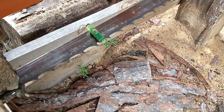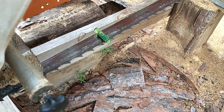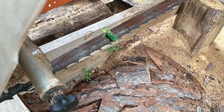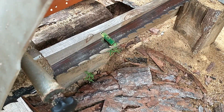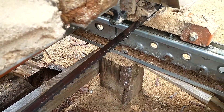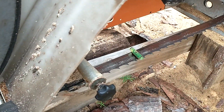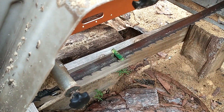I've adjusted the blade — it was just a half a turn from the manufacturer's suggested setting. You want to do this with the blade fully tensioned; track it first because that'll get you close, but now I'll no longer have that dip — it's gone. I've adjusted both guides so they're not scraping the blade when it goes around, and I should be good until the next blade change. I do this every blade change.